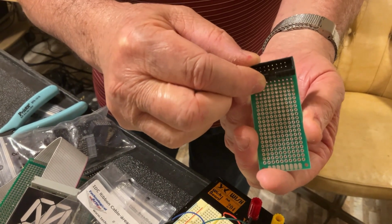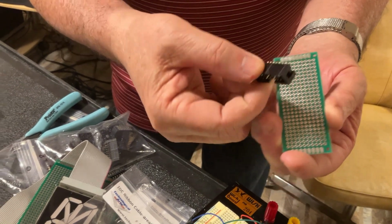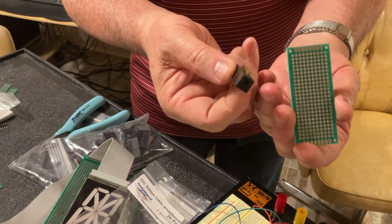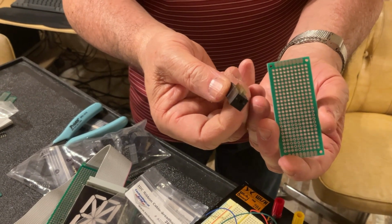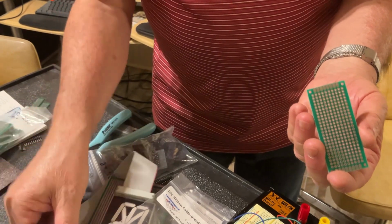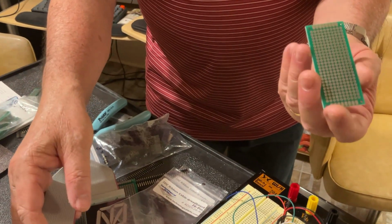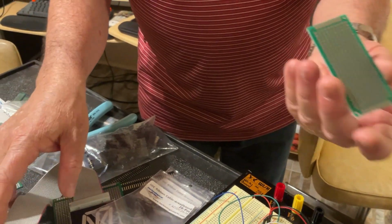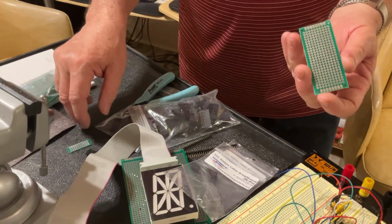So it's going to fit somewhere here in the middle, you see? It's fitting perfectly. But the same is going to be for the one with 20 pins, because it has 2 times 10 pins. Obviously, if you need to make one like this, which is 26 pin, you need a larger protoboard. But this one is perfect for 16 and 20. So we're gonna make one, okay?